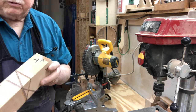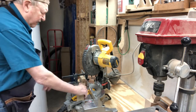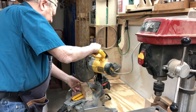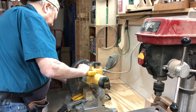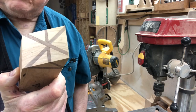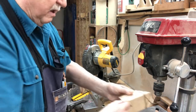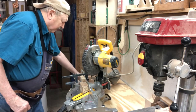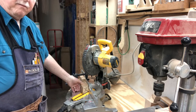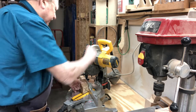Once I get this one done, all four sides will show an X. We put it in — we always cut from the same end, from the end that has the arrow on it, like the other three sides. As you can see, we can see the result of the other three cuts that I made. I'm going to dress this edge up a little bit with sandpaper. The width of the cut needs to be pretty close to what the kerf for the blade is, so I'm adding just a little bit to the cut here.